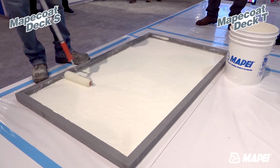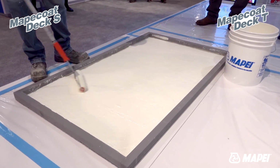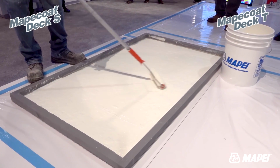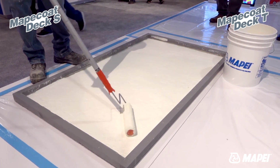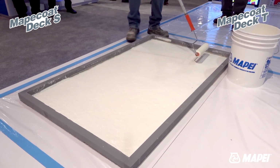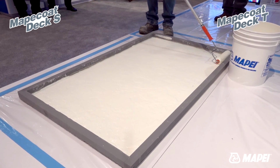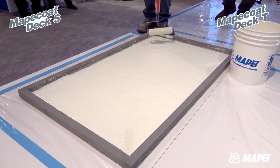Very nice. Now, you can see it is a little bit transparent on the first application. This is a very thin film application. It goes on at about 400 square feet per gallon. So we're talking about maybe 4 mils, 5 mils wet. I do recommend a second coat application here.